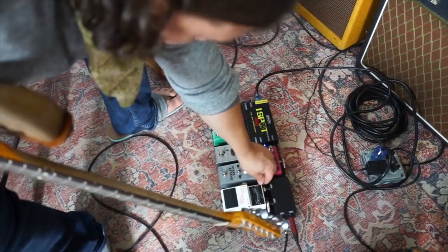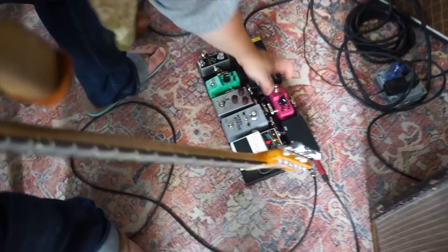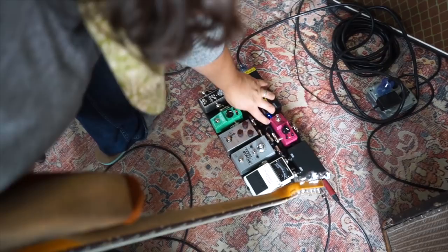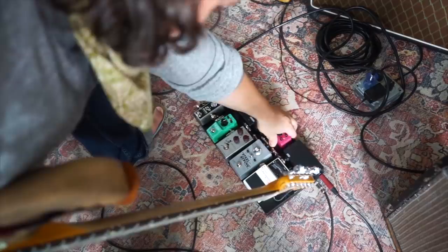Don't hear anything there. The other thing I want to do is the same to the power. Now, in some of these, because they're true bypass, even if the power disconnects when they're off, you won't hear anything. So I'll engage the pedal, I'll wiggle the DC jack, make sure we don't have any intermittent there. Everything is sounding as it should. It's all checking out so far.